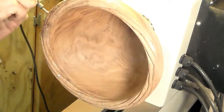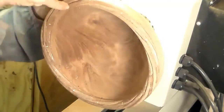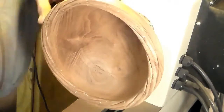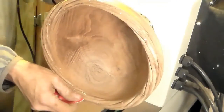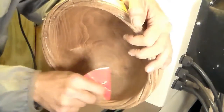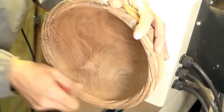So I'm finishing up with the little barrel burr. It's just a standard burr that comes with a lot of the Dremel sets. Finishing up with that, and then I'm going to switch over to sandpaper, and I'll start sanding all those little lines. This is just a folded over piece of 120 off of a, well, it's made for an orbital sander. I go through a lot of those. And then after this, I'll switch to an emery cloth. It was a 120 emery cloth, and I start sanding with that.